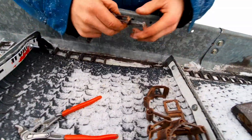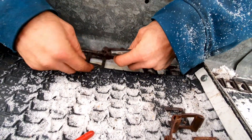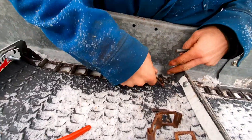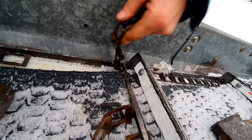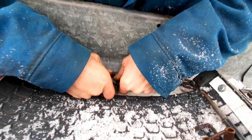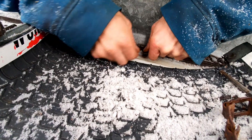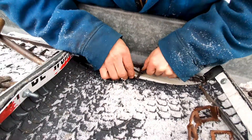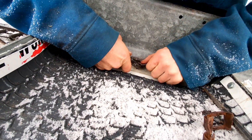Okay, so now we've got the four links and you can put them on. You see how the slot is here — you could hammer it through backwards and have that one track that way. You want to make sure — now hammer that in there. This is a little more difficult because there's always tension. You have to get it rolled up like that and then hammer it because you're holding the conveyor. Might need you to hang on to it — I don't know — that might do there.